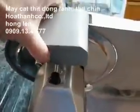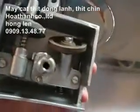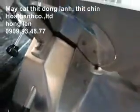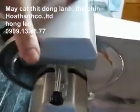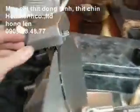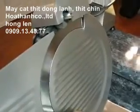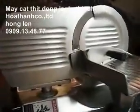Now, all good slicers are going to have some way of sharpening the blades. This thing turns around, and you see we've got sharpening stones set up to cut at fixed angles. And when we put it down like that, with the motor running, we're able to mash these little buttons here and here, and we sharpen the blade as it runs. You don't need to sharpen it much, just enough to keep her sharp. That's it.